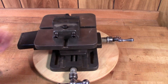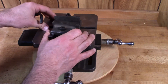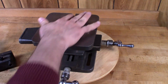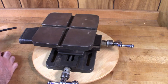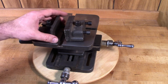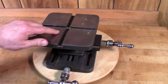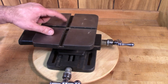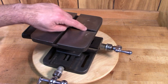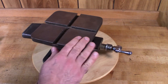There's not a lot to these so hopefully it'll come apart fairly easily. We'll start by taking the vise off — it's held on just by a couple of cap screws. There are a couple of T-slots in the table so you can adjust the vise parts anywhere you want. These are often missing on these tables, so I was really glad to see that whoever put this one away left the vise parts on there. I've got a little bit of damage here where someone had drilled holes into the table — nothing major. There are a couple of little dings, but overall it's in pretty decent shape with no chips in the T-slots and no real rust on the top either.